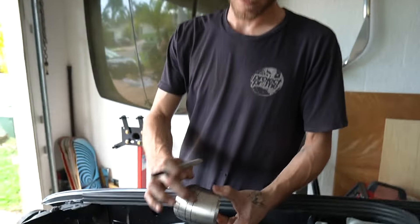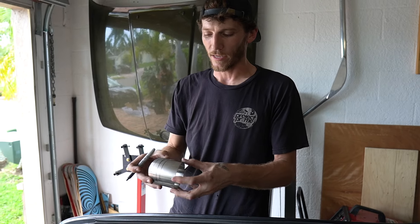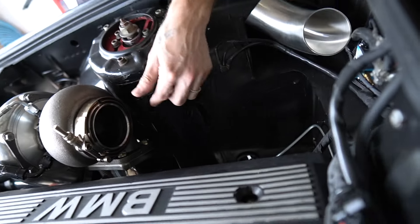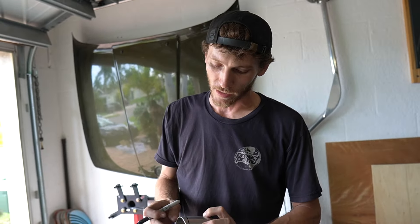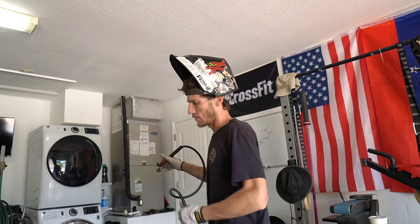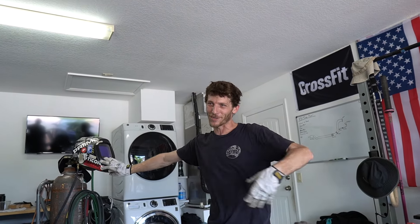We'll tack this to a piece — it'll make it easier to cut, get it off the bench some, make that cut and start from there. We'll cut back on the mandrel bend to get it looking down, start with the wastegate and start plumbing that over. I'll just make a couple of tacks to hold the piece, then take the bandsaw and cut around it. Lot of back and forth through this part.